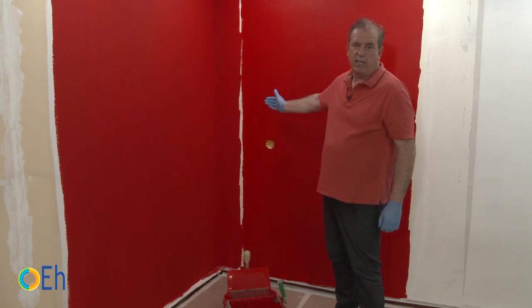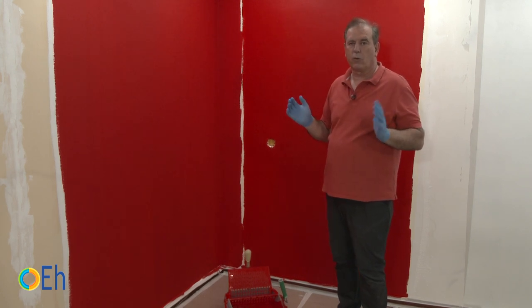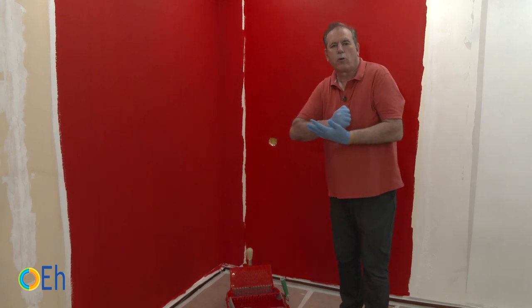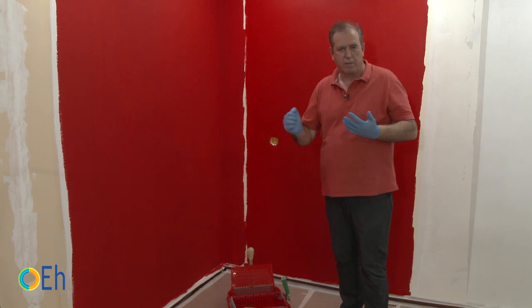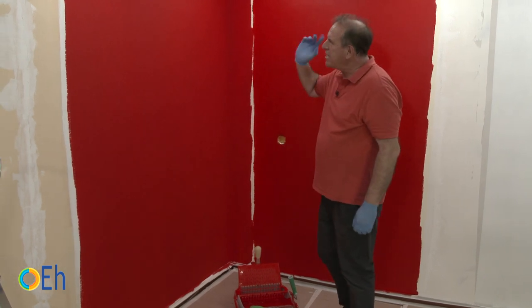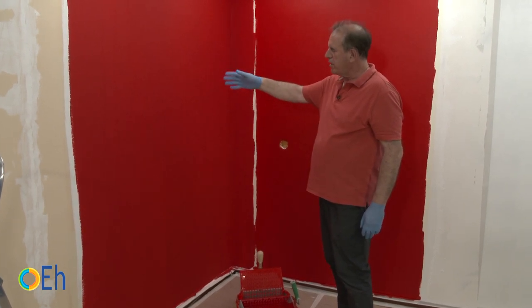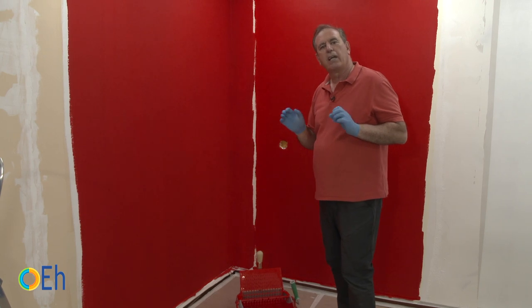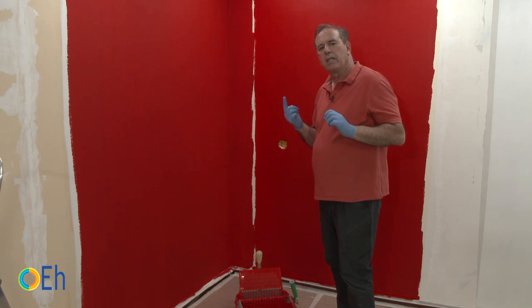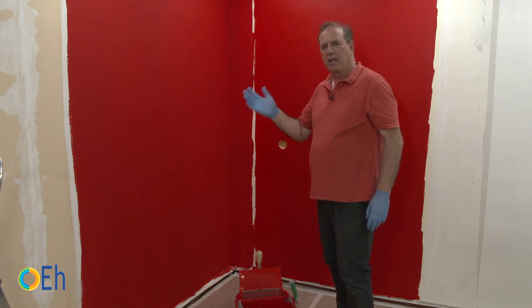This wall — no matter how much I rub it — has resin on top. I will not remove the pigment in any case. Scratches and friction on this one are practically not visible. While on the matte, there is pigment on the surface, so as soon as I rub it, it is easier that some material is removed and that is why it is less washable. Let's give the second coat to see what the finish is, because you've already seen that after drying there have been areas with marks. Sometimes you say I have areas with different color — that's logical. When the first layer does not cover enough, it needs more color in some areas because the painting is not applied in a totally homogeneous way.